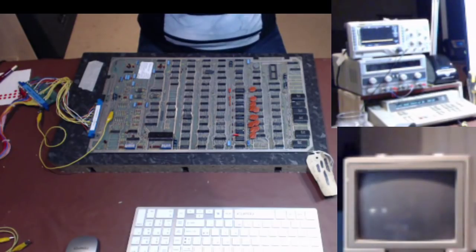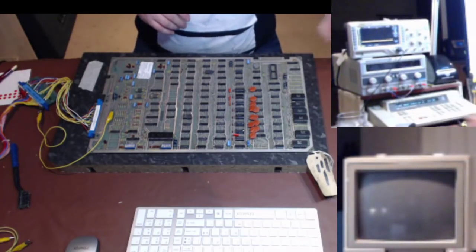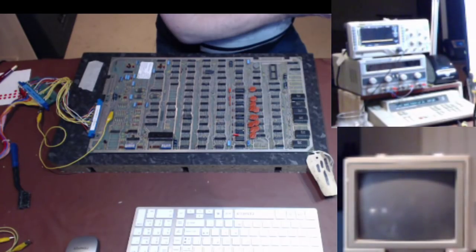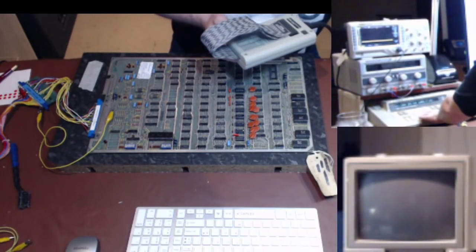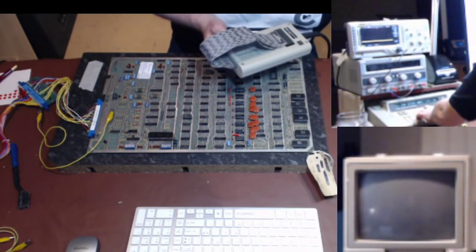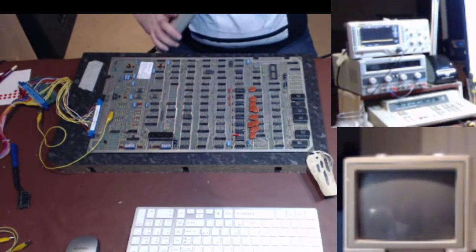You can't see me doing the brushing because I'm keeping any flecks that fall off away from the PCB. So we keep the CPU over there out of the way, and we grab the old Fluke test probe. We'll just do a quick manual test. Auto, yeah, bus test, 6502 pod, which is what this is. Configure the Fluke to not bother about the bad power supply and to ignore the reset as well. So this is how I work with awkward boards with the Fluke.